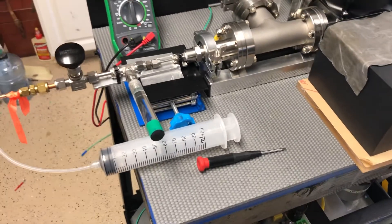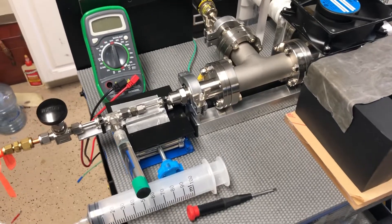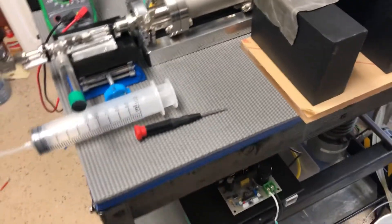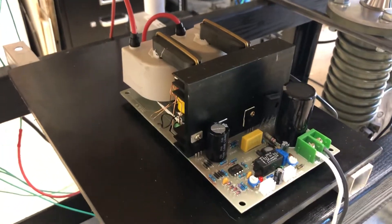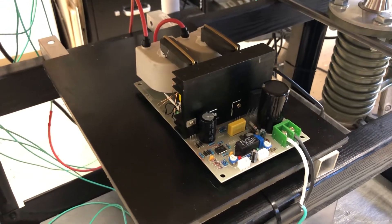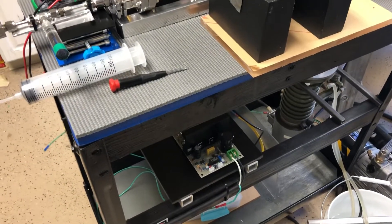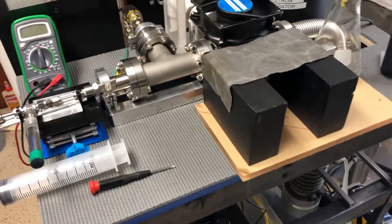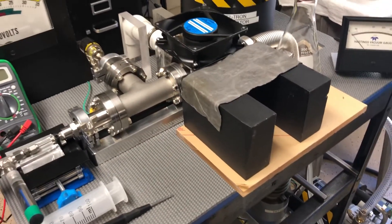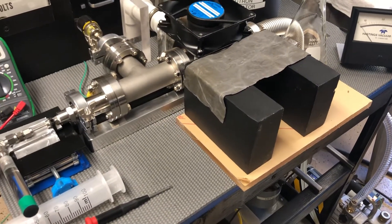Here's something really good that I think is going to be great for amateur fusion. I was reading in the fuser forums about six months ago — Finn Hammer and several others were talking about using precipitator power supplies. So I bought the 30,000-volt, 10-milliamp precipitator power supply powered by 220 volts. I can't say enough good things about it — it puts out every bit of power it claims. I've had no issue with it going into overcurrent mode and turning off. It's got plenty of current, and my fusion run was actually under-utilizing this $50 power supply. I have the larger 12-milliamp, 60,000-volt supply on the way and will be testing it in the next couple of weeks.